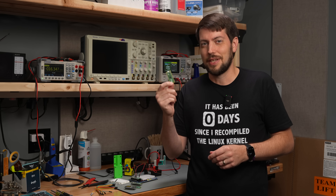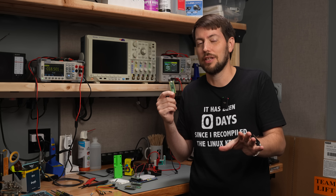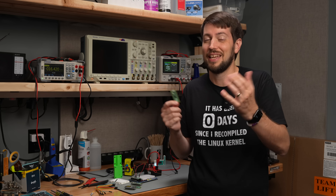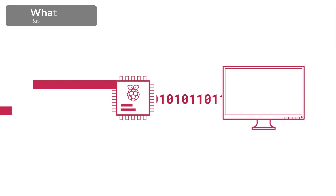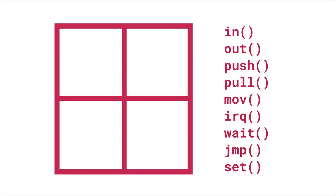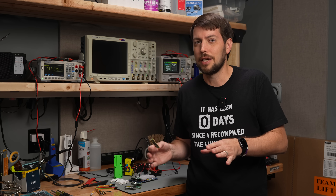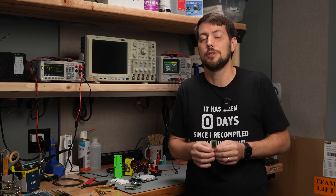Now we'll get to the differences, and they're all hidden away inside here. This chip has a faster base clock — 150MHz — and I haven't tested overclocking it yet, but it should be easy to do that, and Tom's Hardware already has an article up with some of those results. A headline feature of the Pico was the built-in PIO, or Programmable I/O. PIO lets you build your own communication interfaces using GPIO pins, and people do wild things with it — like Clem from Element 14 built a custom video card. The Pico had two PIO blocks, and the Pico 2 adds another one, so now there are 12 state machines available to programmers.